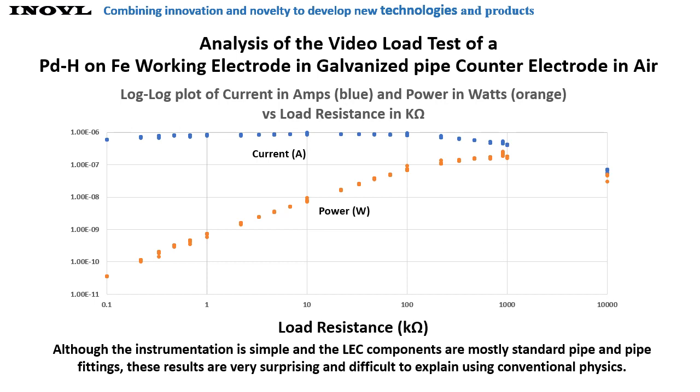A company in Florida advertises a P100 nanotritium battery that uses 225 millicuries of tritium. While the data on their website is limited, it appears that the P100 nanotritium battery produces approximately the same energy as the LEC in this test. Scaling the nanotritium battery to 1 watt would require more than 200,000 curies of tritium radiation.